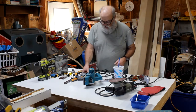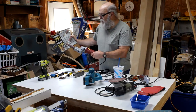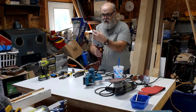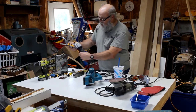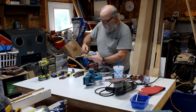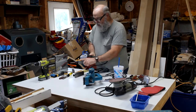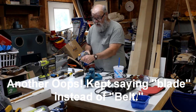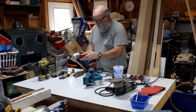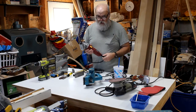The latest tool I picked up yesterday is also from Harbor Freight. It's called a half-inch band file belt sander, and it has a 180-degree swivel head. There's a little belt here that spins around — just a very narrow, half-inch wide belt. You can adjust the angle; if it's a tight place, you can angle it. There's an adjustment screw to lock it into place. They have a lever which releases the tension on the blade when you want to change it, and a knob for tracking to keep the blade centered. They retail this for 40 bucks, but with the 20% off coupon you can find everywhere, that drops it down to about 30 bucks.